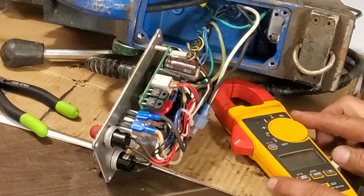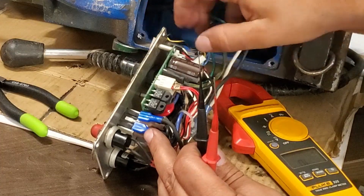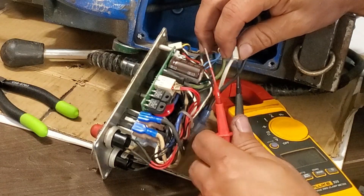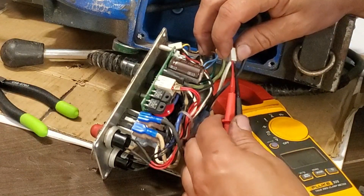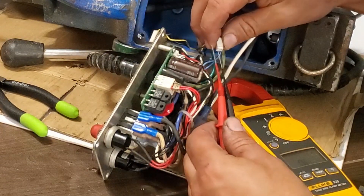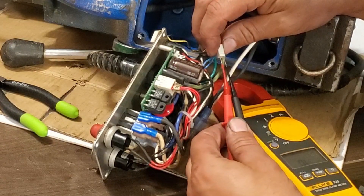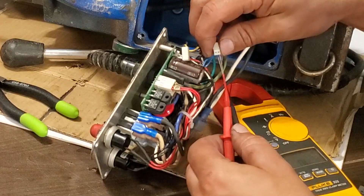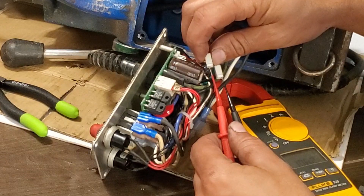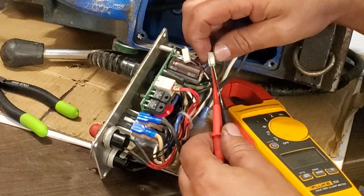One last item I check is the magnetic base coils. There are two electromagnets that hold the drill in place while drilling, powered by two sets of wires consisting of a yellow and a black wire. I unplug these connectors from the board and probe them individually measuring the resistance of the coils. One thing I found a little odd is that the ground wires for the coils appear connected to the opposite connectors — this has no effect on performance but makes it trickier to test. I connect one lead to a yellow wire on one connector and the other to a black wire on the other connector, then check the opposite ones. I'm getting a reading of about 107 ohms on each magnet, which looks to be in the correct range.